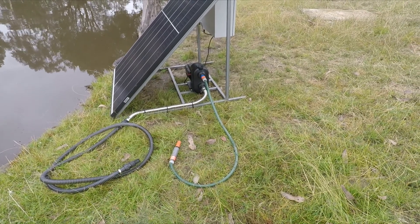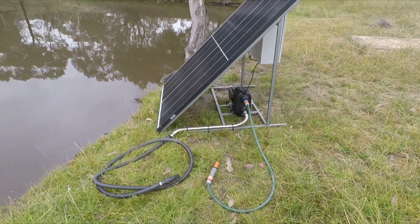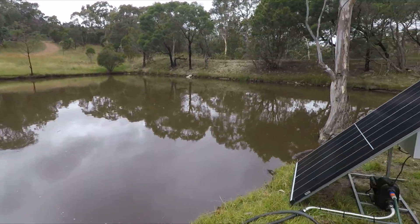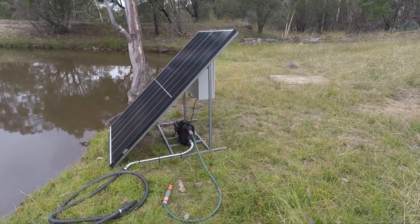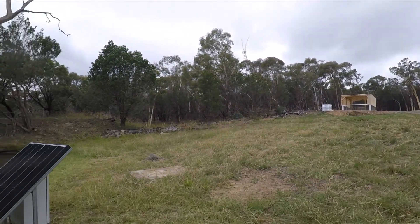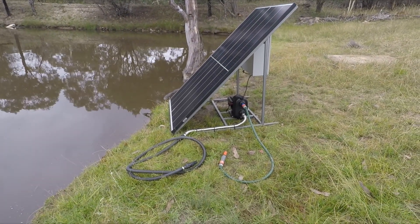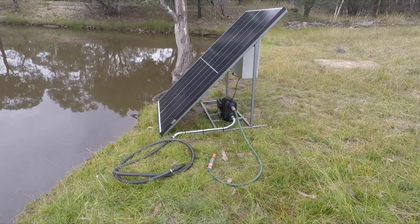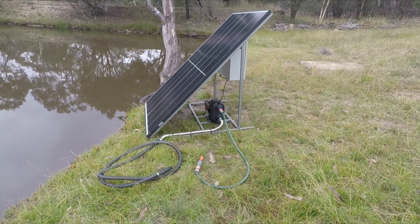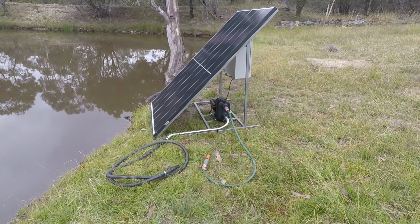This is just to do a test and show how it works. Normally this would be connected to the dam — we have one dam here which feeds the house and some of the paddocks, and then another one about half a kilometre down the road. We've got about 15 metres of head here, and a 25 mil irrigation pipe is more than enough for this application. If pumping long distances, you need to go bigger and all the pipe size calculations need to be done.